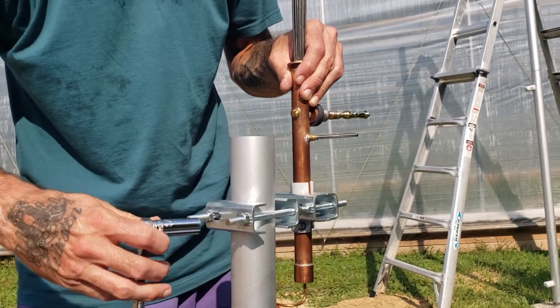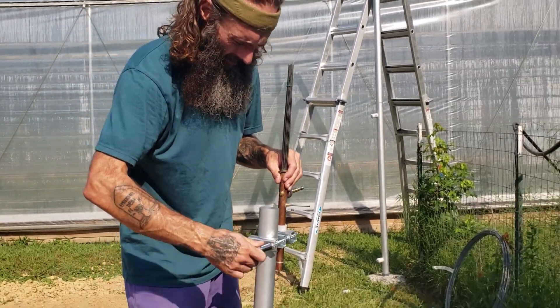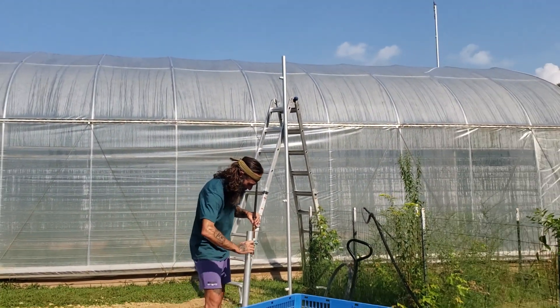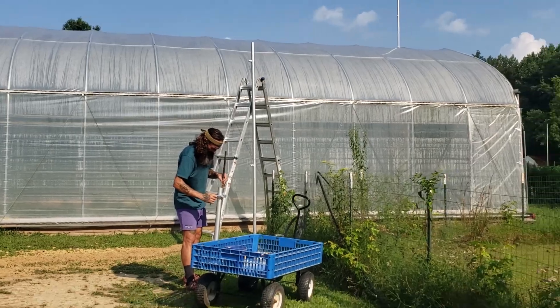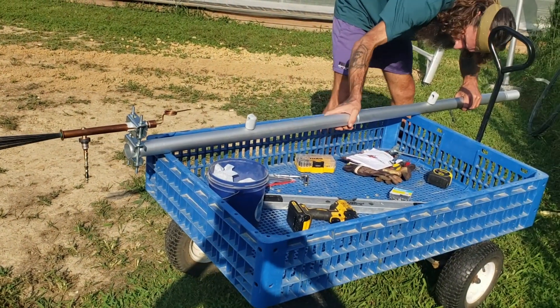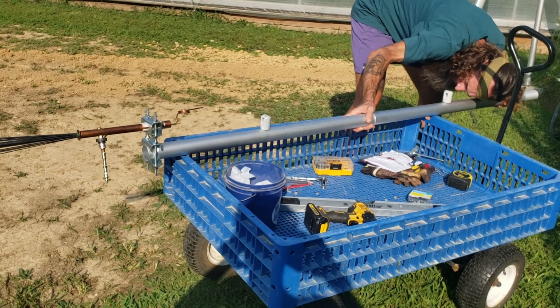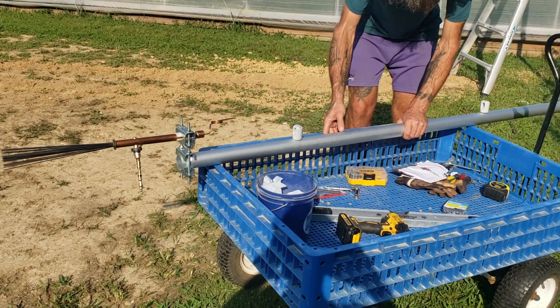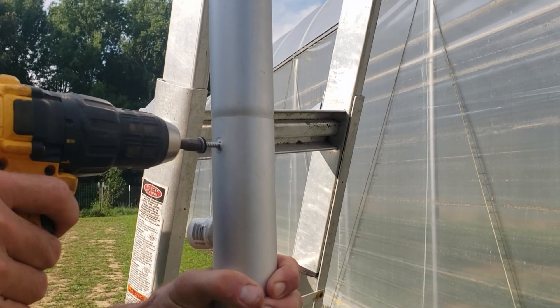This is a mast-to-mast antenna mount. There are other options for mounting the antenna — you can use a PVC sleeve over the top. The gray PVC is far preferable to the white because it doesn't photo-degrade. I'm just lining up the insulators to make sure they are in a nice straight path that will follow the wire down to the ground.